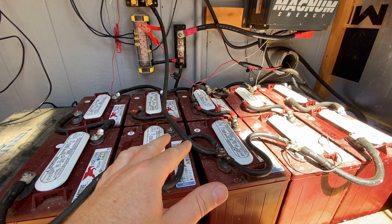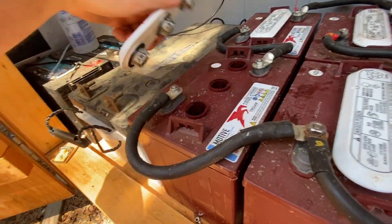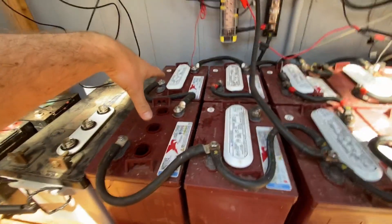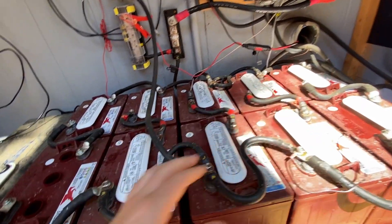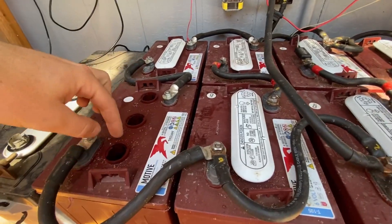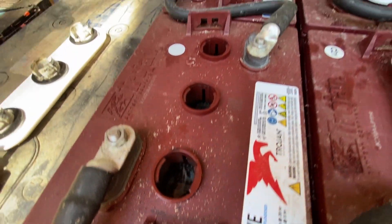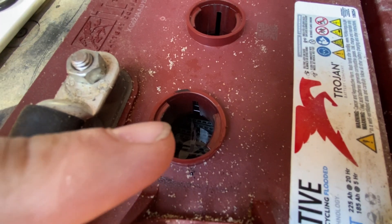The main thing you should be doing as part of your lead acid battery maintenance is checking the fluid levels. If you have a lithium ion or lithium iron phosphate battery bank, this isn't really going to be super helpful to you, but with lead acid batteries, each one of these holes is a two-volt cell — so this is a six-volt battery. I have this battery bank wired in series-parallel, so it's a 12-volt system total. If you look in there you'll notice there's fluid and you can actually see the lead plates down in there — those things that kind of look like the end grain of a piece of cardboard.